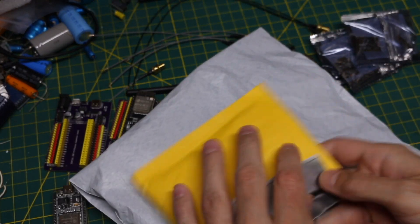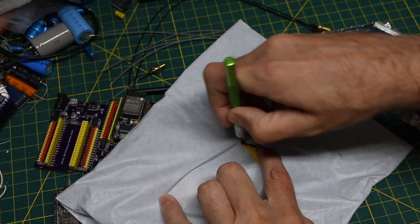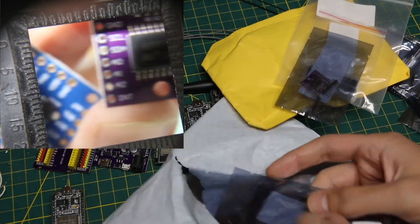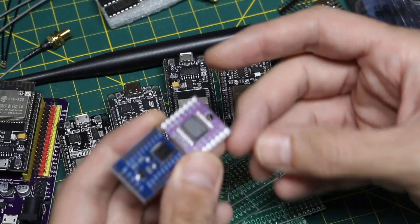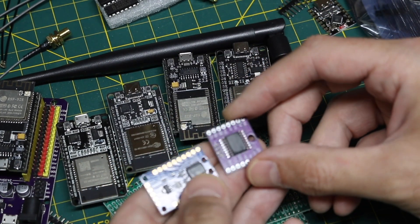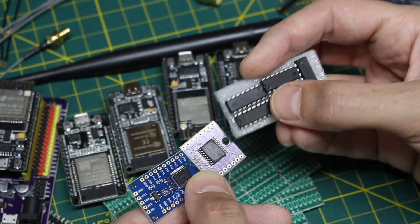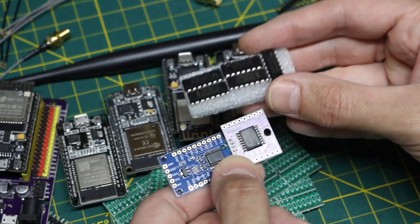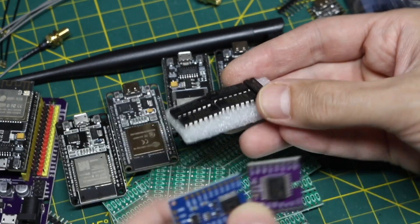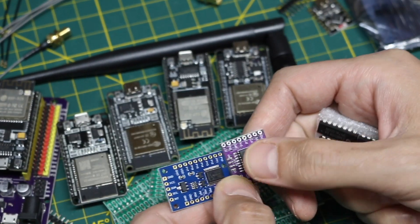A couple of packages that I think belong together. Surface mount PCF8574, and this should be the PCF8575 16-channel GPIO expander — I2C interface for 8 or 16 channels. I wanted these as modules where I could put headers and plug them into a PCB, or if I want to stick with 8 channels, I can directly use the DIP version. On an upcoming PCB these are meant to be optional, so I just need headers or a board socket, and optionally plug these in for extra features. Otherwise I would have just designed the surface mount chips right onto the board.